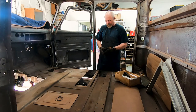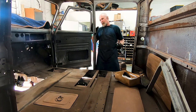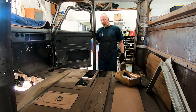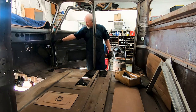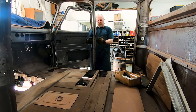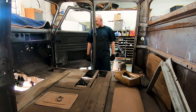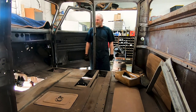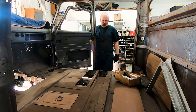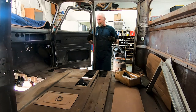These are the 49-to-52 Ford F1 door hinges — there's a front number, an upper and a lower. I've thought about a couple of different plans. I want a door post and I want conventional opening doors, because that's how it would look factory. It's easier to do a suicide door on the rear, because you can just take a hinge post and the stock hinges with plenty of meat back there to hide all that stuff. Then have both doors lock on the front. I guess it would be cooler having double door handles right in the middle like a continental, but that's just not the way I want it done.